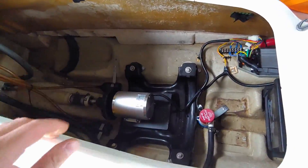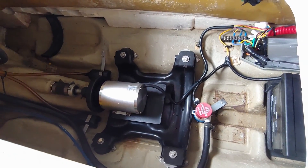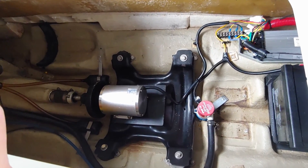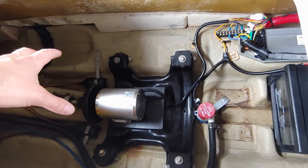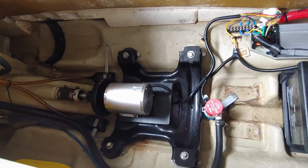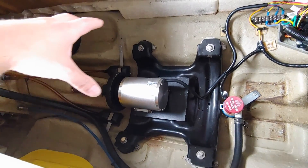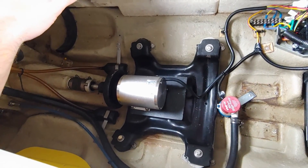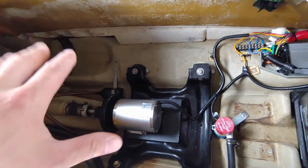Alright guys, it is a new day. The new motor's in along with the controller, everything's wired up and working - you can see I can hit it and it works perfect. But before we head to the lake I want to talk about expectations. I don't expect this to perform a whole lot better than what we already saw, because I think we're really limited in RPMs. I don't think in the water it's going to get up to 4,500 RPMs. Whether the jet pump rebuild helped and whether the old motor was bad from the get-go, we're going to find out. The only way to really get this thing to go faster is to use bigger batteries and/or a bigger motor.